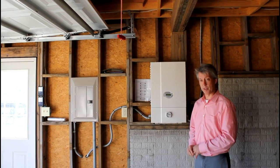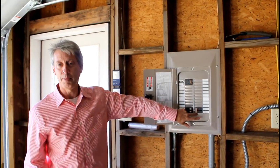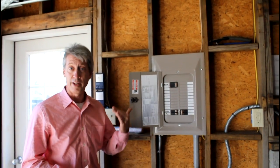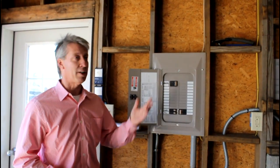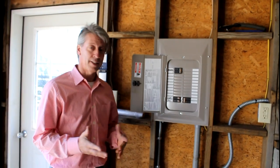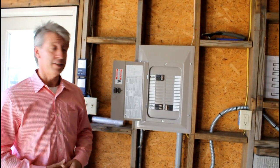There are a couple of other ways to recognize revenue, one being solar renewable energy credits. This is the electrical sub panel — relatively straightforward. We're taking the output from the inverter and back-feeding a double-pole 30-amp breaker. With 4.32 kilowatts — that's 4,320 watts — or 24 panels times 180 watts per panel, those are all equivalent ways to quantify the potential output of the solar array.